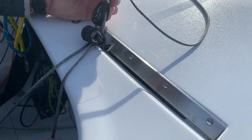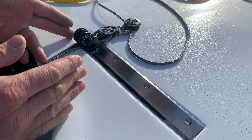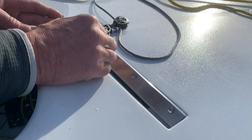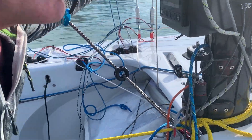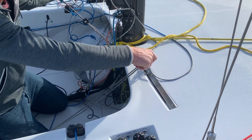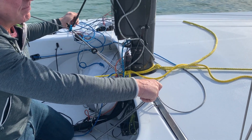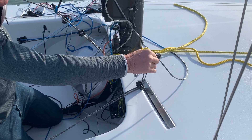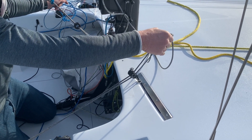We've just gone with a slot in the deck — this nice molded contour here to take the line, the up/down line, below deck. Basically we've got anything from about five degrees to nine degrees of sheeting angle here, controlled by control lines on the other side of the boat. The up/down line gives us the traditional fore/aft track effect — further down makes the sheeting angle steeper, and as it gets let off it makes the sheeting angle flatter, just like cars forward and back in the good old days.